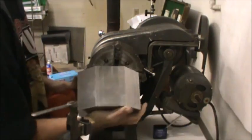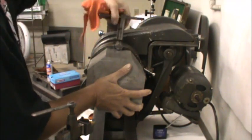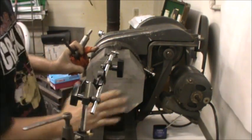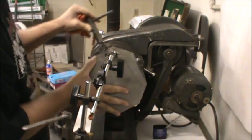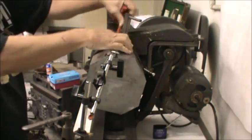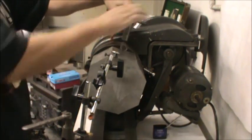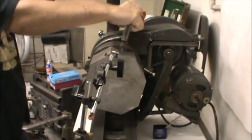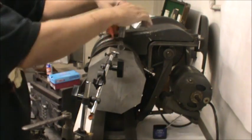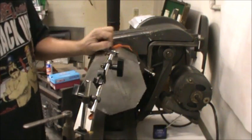Next, I'm using the four-jaw chuck to hold the piece in the lathe. I have the jaws reversed and adjusted close enough to clamp the piece. I give it a final wipe, place the piece into the chuck, and hold it firmly against the chuck as I tighten each jaw against it. I use an indicator to get the piece close — it doesn't need to be exact since the piece is not square, I just want it to be close. I now have it where I want it and go around the chuck tightening and re-tightening each jaw. This is a very large piece for this small lathe and I want it held really firmly.